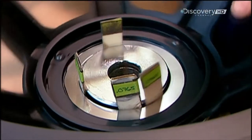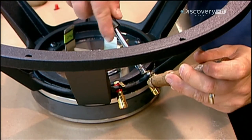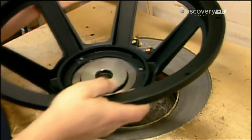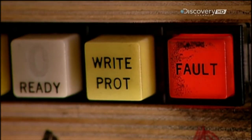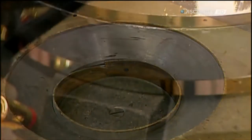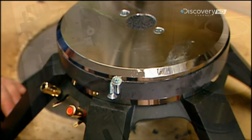The core fits through the large hole in the front plate. They insert shims to centre it while the glue dries. After screwing terminals to the basket, they put the entire structure into a magnetising machine with 600 volts of direct current. The machine creates positive and negative poles, transforming the magnetic structure into a permanent magnet, meaning it has a constant magnetic field around it.